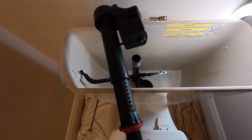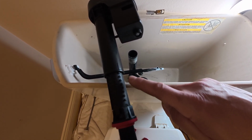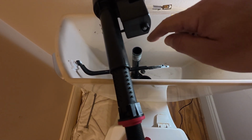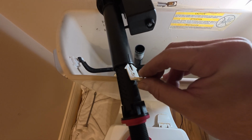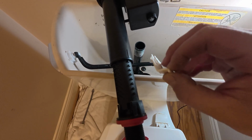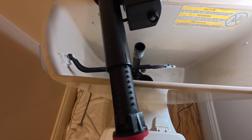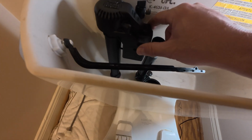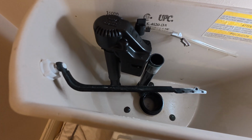All right, here at the next step, I'm going to show you something outside of the toilet on the valve that's hard to see once this is down in the toilet. But this little piece right here is letting you know how many notches you are up to be level in the tank properly. That clip I showed you at the beginning of the video is showing you how you lock that in place. And you're supposed to push this up in there and have it snap in these other two that are exposed so it cannot rotate down lower. Now, why that's important and why I showed you that now is, like I said, once I put this in here, you can check this and try to get it exactly right before you put it down in here. I advise to wait to lock it in with this tab though until you know your water levels are correct.